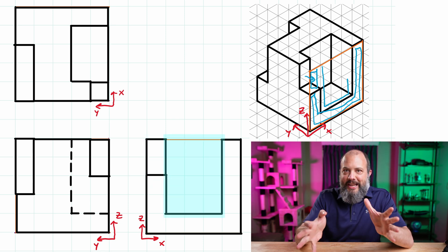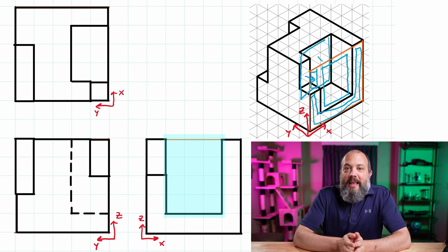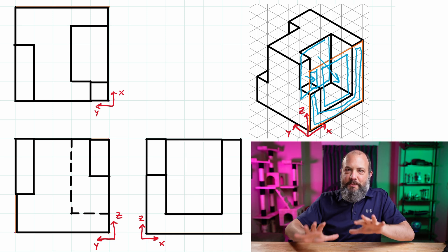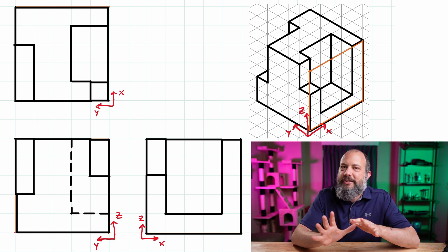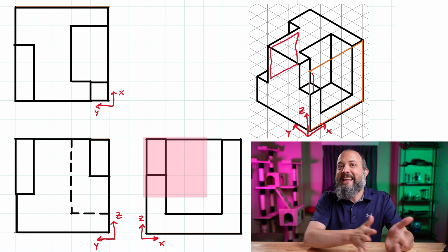The whole middle section represents that big flat face right in the middle of the drawing. At this point I've darkened in the entire right side view — there are visible faces for the entire area and no holes that go all the way through — but there are hidden lines necessary, since there's a red face all the way on the left side of the part that would be hidden behind other pieces when viewed from the right.